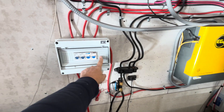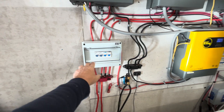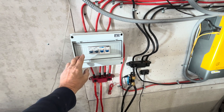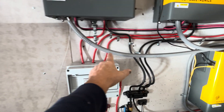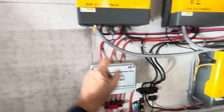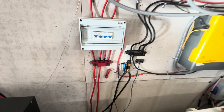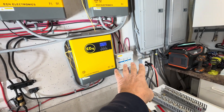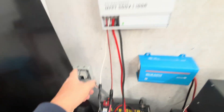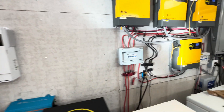We're not going to touch the existing setup — it has enough capacity for two more inverters. We can put two on this side and two on that side. We'll run a black wire down into the bus bar so all four inverters can be shut down together, and the two breakers for PV going up to the solar panels will allow us to shut down solar input independently.